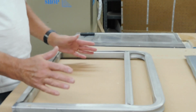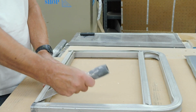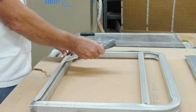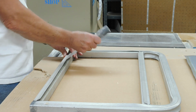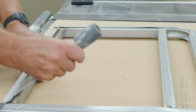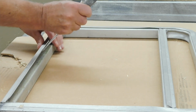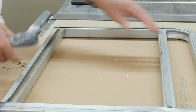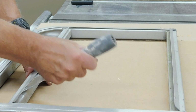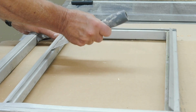so I can spring it into the sides. One of the things you may run into, and I've done this before and had it happen, is when you do pull and pry this up, you want to do it gently, like this, or it'll break off. And if that happens, you'll have to pop rivet your new metal back on. You want to be gentle, do a little bit at a time, so as not to crimp or crease or make it overly crooked. And you don't want to pull it all the way up because you'll definitely break it off then. I can hear that's getting a little crunchy down there. It's important to use something very, very stiff and wide so that you're not distorting the metal too much.